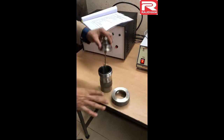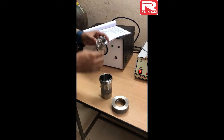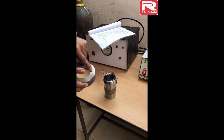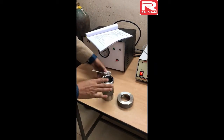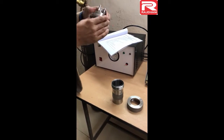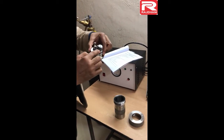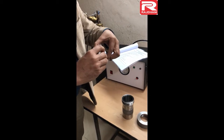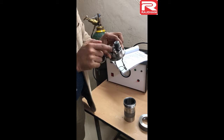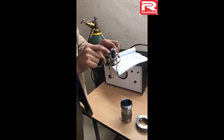This bomb is made up in three parts. This part is called the tumbler part of the bomb. This part is called bomb lid and this part is called closer ring. It has some serial number engraved over it. The main part of this bomb is the bomb lid because all the fittings are there in this part. This is the bomb lid. This is the valve body and a valve is fitted inside this valve body through which air goes inside. In the center there is a hook to lift this bomb when we keep it in the water and when we lift it from the water.